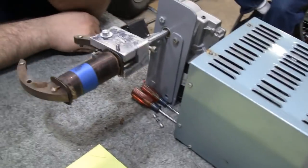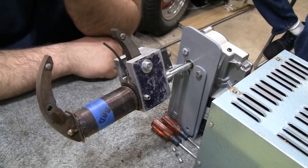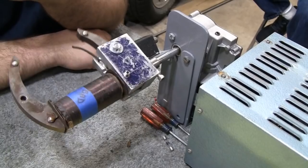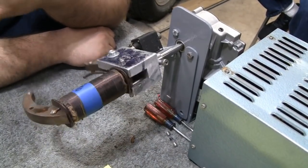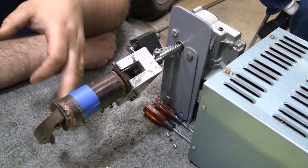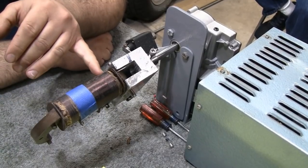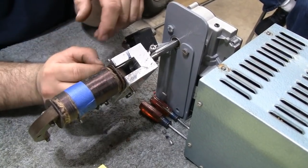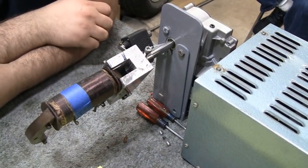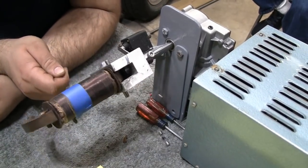This is the best setup yet. What's the procedure and how many hours goes into this? Well, we just ran the numbers and at this winding speed you're looking at probably about five and a half to six hours of actual winding — just wrapping the secondary wire on the core. That does not count stopping between each layer to put the insulating paper on and other prep work.